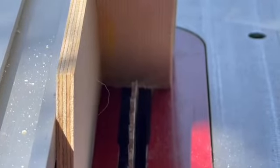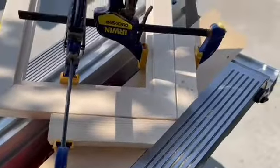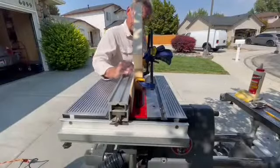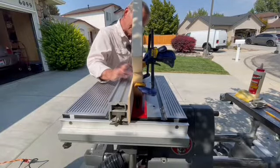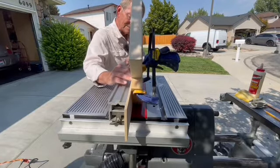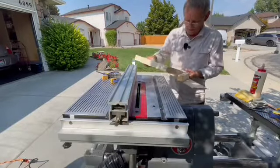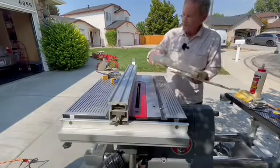You can see we're going to be cutting that groove for the spline right down the center there, or at least close to it — looks good. I've gone ahead and clamped the frame to the jig; it'll just hold it in position better. Now it's just a matter of passing all four corners over the blade. Take your time with this. Rotate it, do it again.